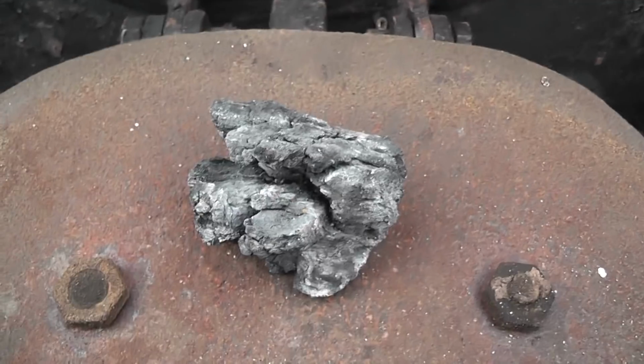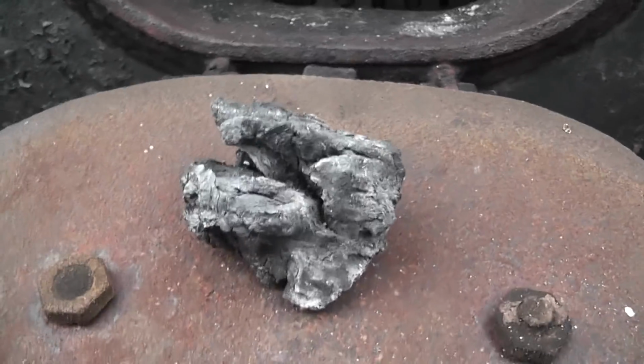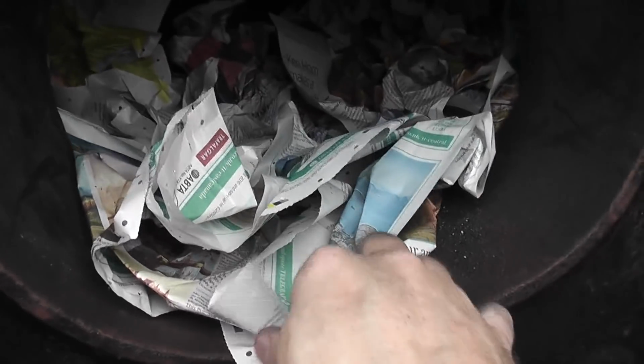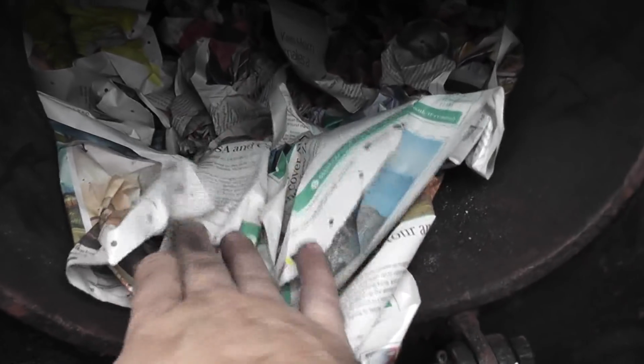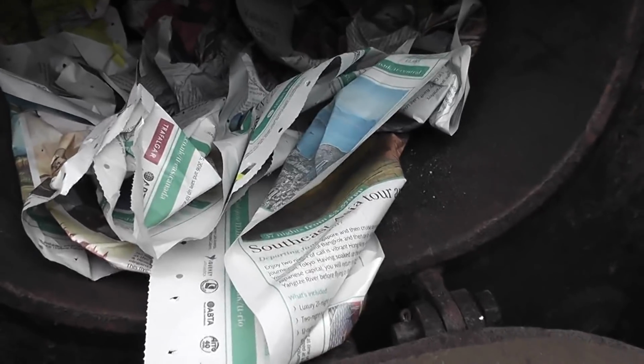Quite often at the end of a day steaming you get a bit of unburnt or partly burnt coal, and this can be reused, so that goes in on top of the paper at the back there. And here is the bed of paper we're putting in, ready for putting the wood on top. Here we are, all the paper's in. You'll notice I've left some hanging out the front. This is so that when I come along with the matches it's much easier to light without reaching in.